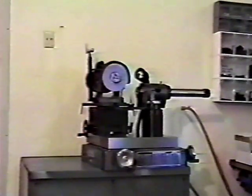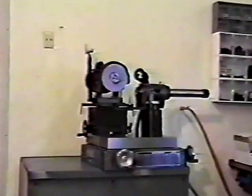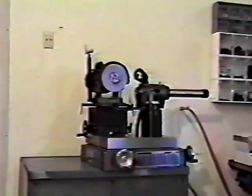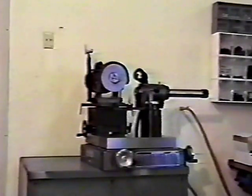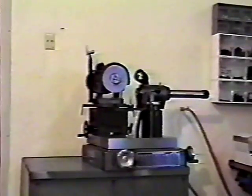The following instructions are for the Z-axis. Install the Z-axis assembly and spindle extension, then install a 6-inch 12V9 type dish wheel and dress if needed. 4-inch and 5-inch wheels can also be used — please consult with the manufacturer. After installing the wheel, put the rougher and collet in and tighten.